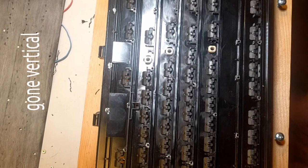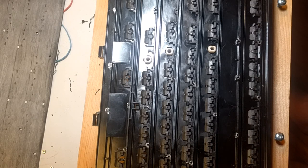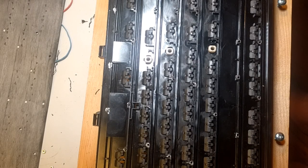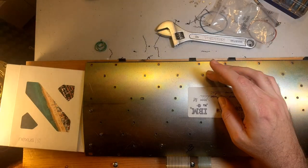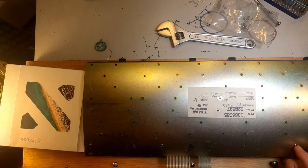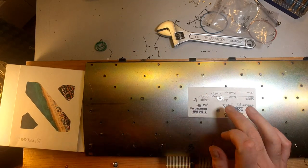Fantastic. I had to remove the backplate again because of this screw right here. I took it out already. There was a screw here before, and it was drilled slightly off center. So when I tried to screw all the nuts down, it actually prevented the barrel plate from fitting against the backplate. So I had to take it apart and reseat the feet. And I took the screw out, and I know for sure now that all the bolts that are left in there will be through and through both the rubber mat and the backplate. So, got the base plate re-tacked on here. Have 1, 2, 3, 4, 5, 6, 7, 8, 9, 10, 11, 12, 13, 14, 15, 16 bolts in it at the moment.